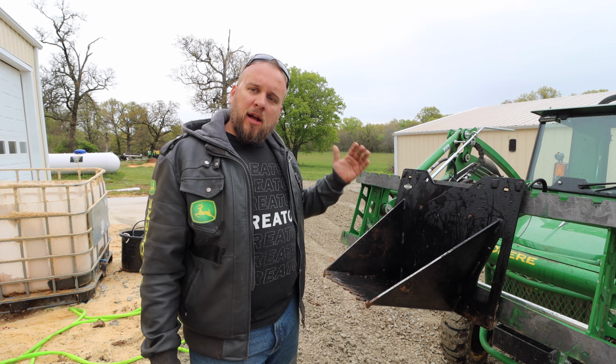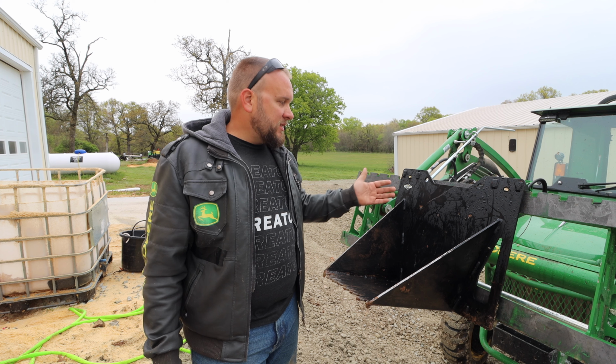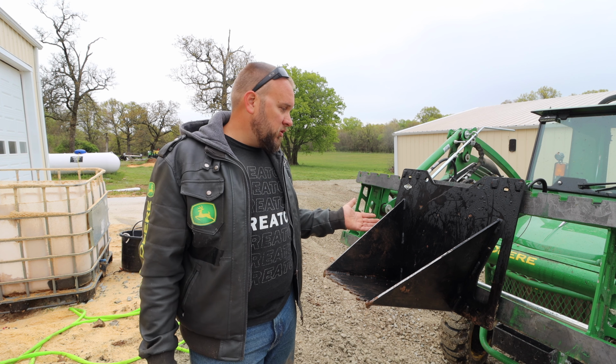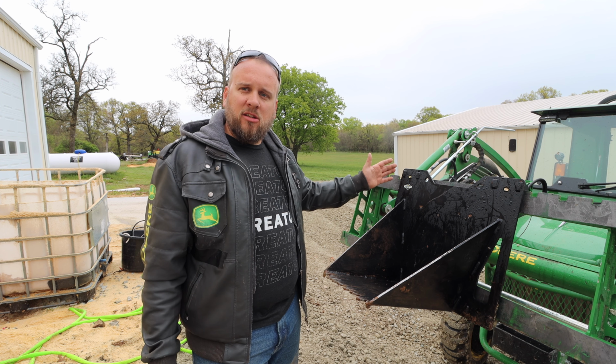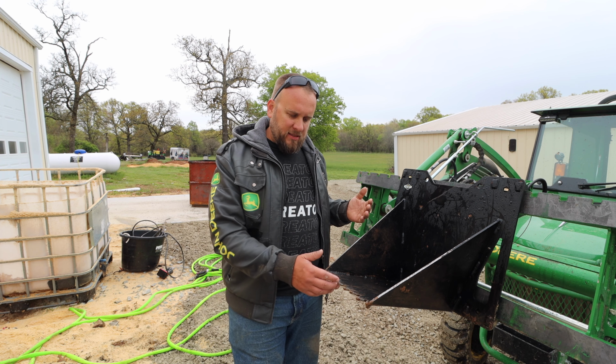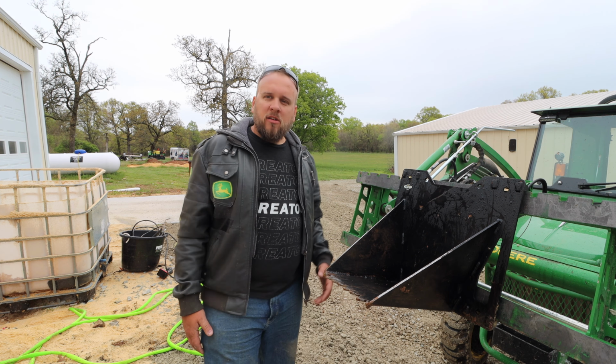So, in terms of the front hoe bucket, it is a stump bucket, is what I mainly call it. It looks to me like about 1/4 inch thick steel all the way around. It slides onto this frame. I think it's about 16 inches long and about 12 inches wide. It's got serrated teeth on the front. So the other day, I was digging out some big rocks over here. I mean, big rocks out of the yard. And I set this right down on top of a rock, angled straight down, lifted the tractor off of the ground with it, and then tried to curl. And I bent a couple of these teeth, so I had to straighten them out this morning.